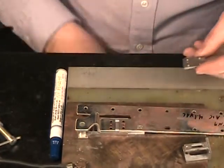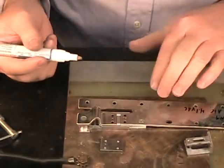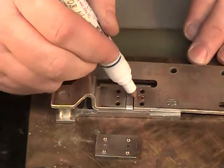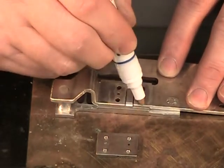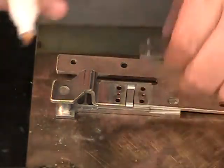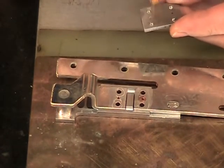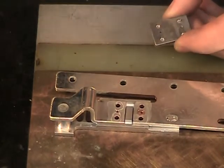Wipe that off. Now what we're going to do is — they did provide a flux pen. This is a 951 Kester flux material, and we're going to flux the area where the solder is intended to flow. We'll put a little extra in the holes — hopefully that will help draw some solder in there. The sample photos they provided did show solder down in there. The idea also is to have it wet properly on the inside channel. We won't be able to see that until after this project is finished and pulls off, but we want to make sure it fluxes the areas where that solder is intended to flow.